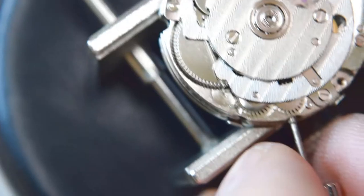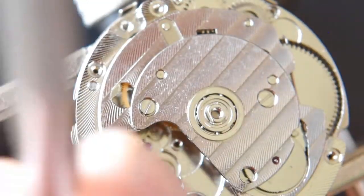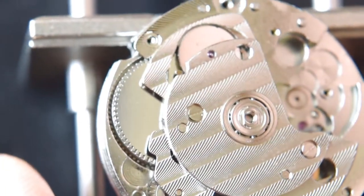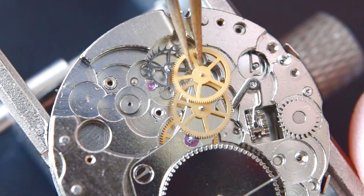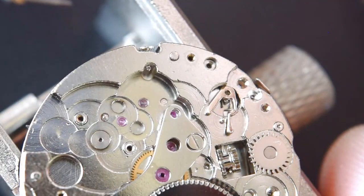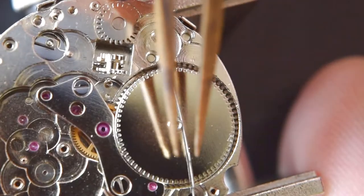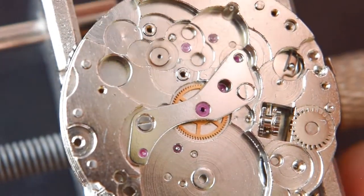The fork is there. I don't need the winding stem. Here is the wheel bridge. This will be the first part, and in the second part I'll do the full assembly. So if you'd like to service this watch yourself as a hobby watchmaker, there is also an additional bridge you have to remove. Here are the wheels, the escape wheel, the sweep second pinion, and this lever is for the hacking seconds. And this is the spring which you should release when you want to release tension on the mainspring. This I will do later — that's simple. But this wheel I will also remove.